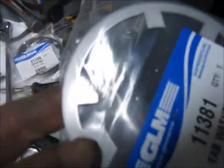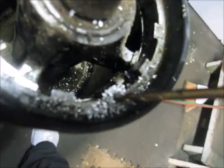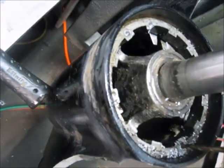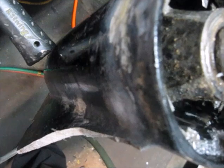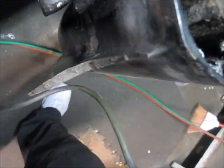The tab washer is made out of stainless steel and it's underneath the cover nut. You'll be able to feel it as you're drilling because it may drill through the aluminum very easily, but once you hit the stainless it's a different story. After you hit the stainless you don't need to go any further. I can feel it - we've hit it already, so it didn't take very long.